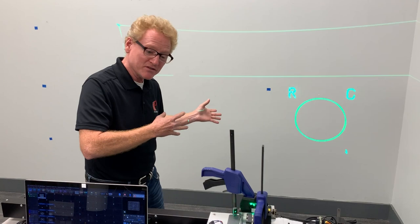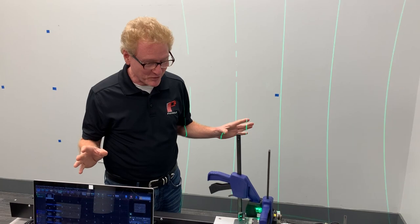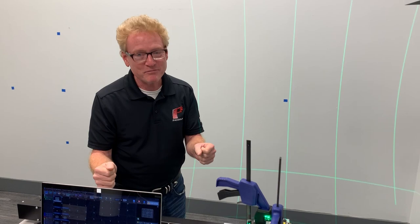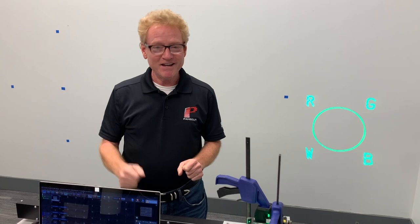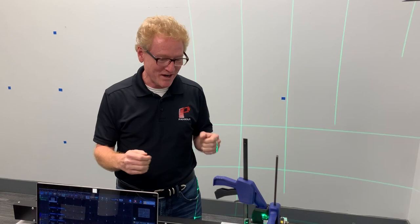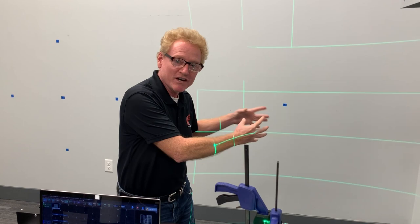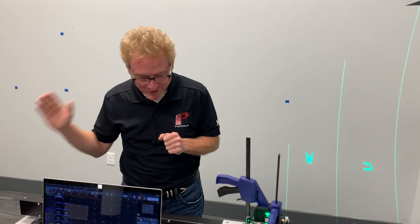So that's the situation — that's what the brown stuff is. It's there to balance the mirrors. If you don't like it and take it off, just think of it like removing all the weights from your car tires: at slow speed no problem, but at different speeds you'll feel the vibration, just like I'm showing here at different scanning speeds. We would recommend you leave it. Treat it like a snake in your garden — leave it alone and it will leave you alone. Thanks for watching.